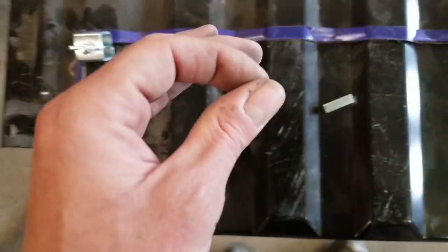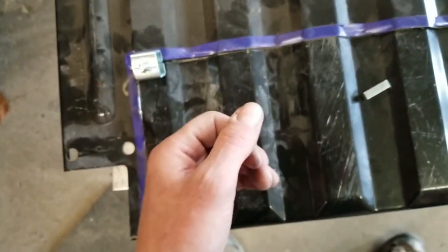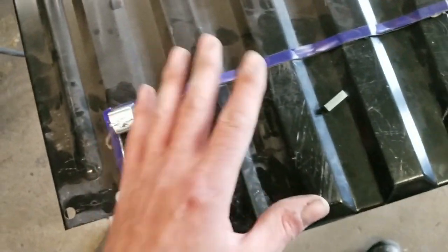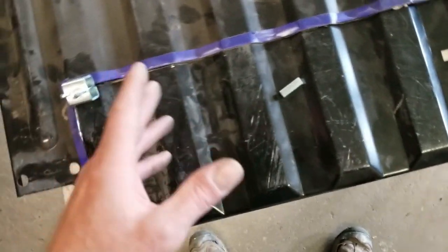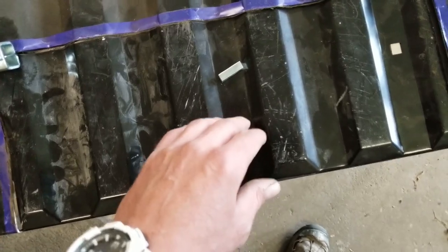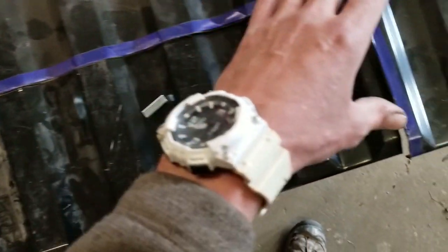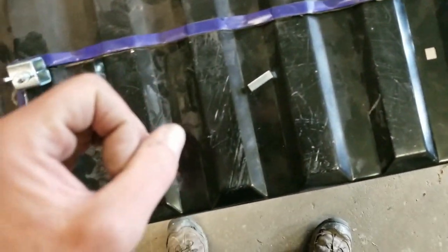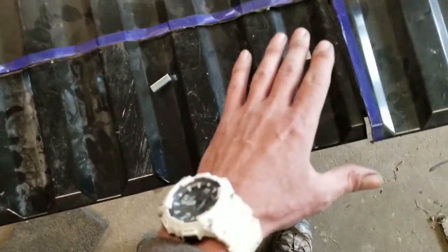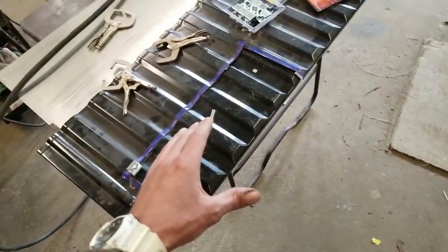A couple of reasons why you need something like this: when you are butt welding, you need just a little bit of a gap to make a good weld. Now I'm not a welder — please don't quote me on that; if you know better, leave a comment and I'll shout you out. But I do know that if you are not clamping down your work piece correctly, you are going to get all kinds of warpage, and that's the last thing I need for this brand new panel.